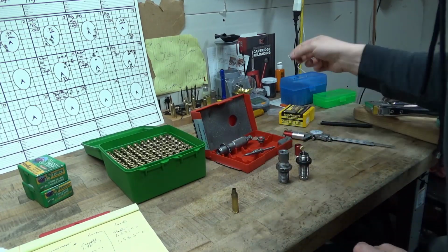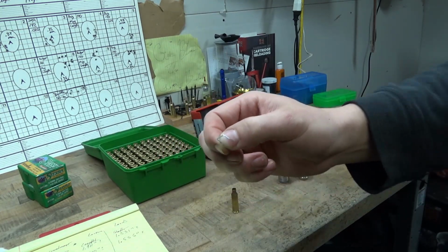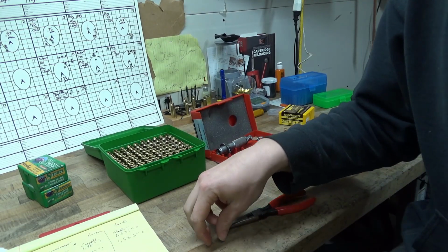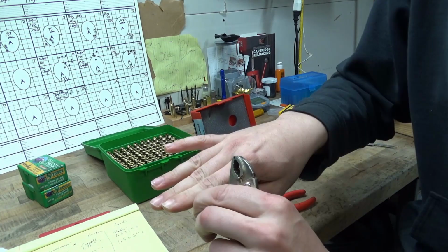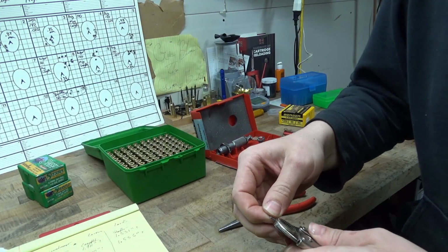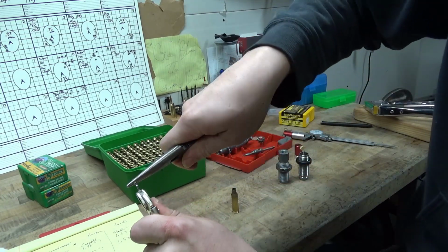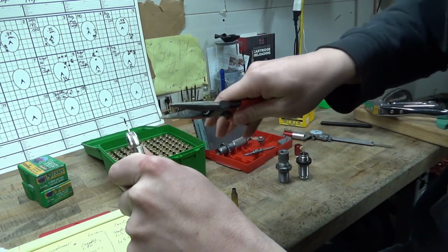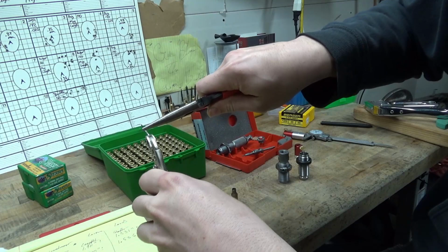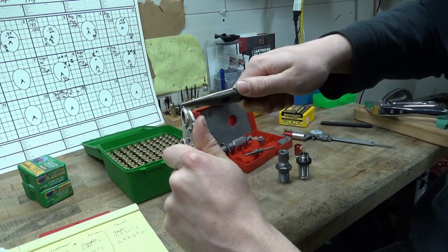Alright, so the staple is like a soft metal, right? It's not a very robust metal, but it's like every other metal. When this was made, originally it came out in a flat sheet, it got bent over, and then it got sliced up into all the individual staples. So it's already been moved on those joints one time. If I move it back out and flatten it again, what I've effectively done is stretched all the molecules in the metal. There's a grain structure inside the metal. And so as you... Holy crap, that's a loud helicopter.